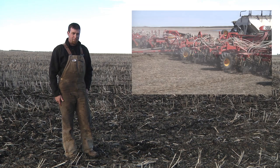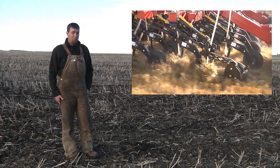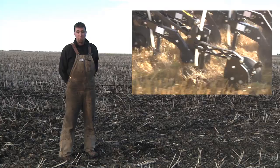Setting up a proper seed bed is very important, especially for independent seeding systems, mostly because the seeding systems we're using today allow us to seed fairly shallow. If you have a very rough or open field finish from a chisel plow or an anhydrous application, being able to go into that same field and seed at half an inch or three-quarters of an inch deep will be very challenging when you're not starting off with something very level.